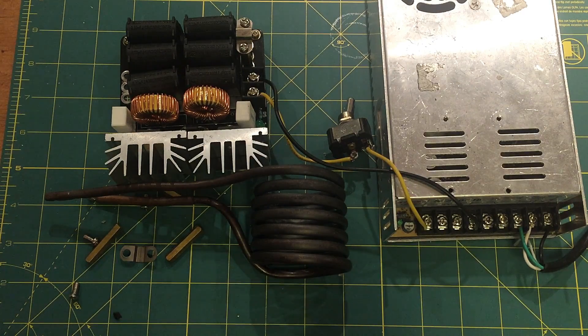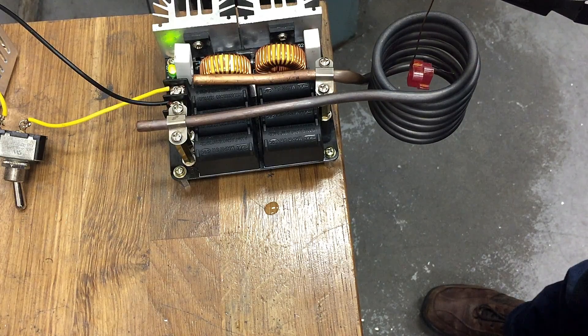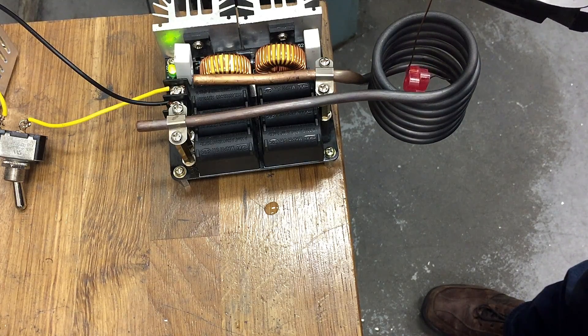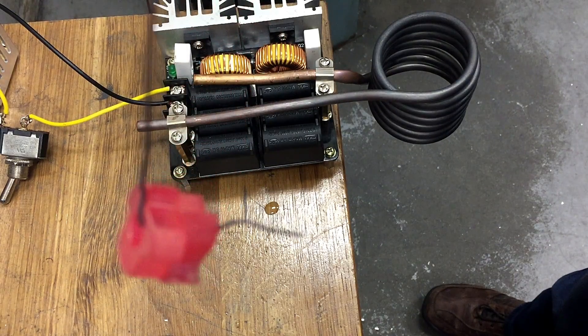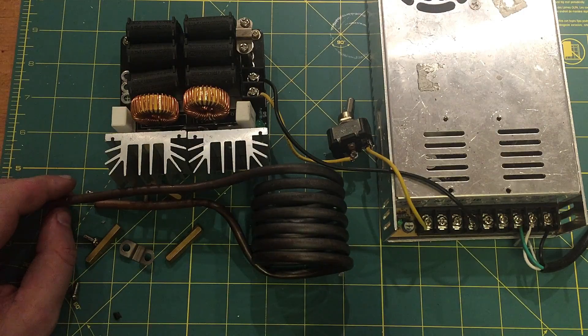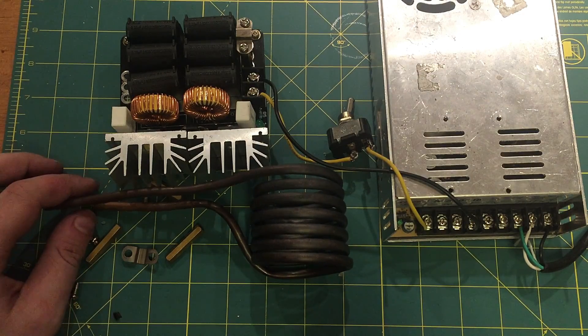I got some pretty good use out of it. I managed to get it fired up and heat treated some steel parts. It easily gets steel up to the temperature that you can quench it at to harden it — 4140 and O1 for example. But A2 doesn't seem to quite get hot enough. For 4140 and O1, they're oil quench steels and you want to heat them up until they're about cherry red. But A2, you want to heat it up until it's like bright orange — that's about 1700 degrees Fahrenheit — and then you can just cool it down in atmosphere.